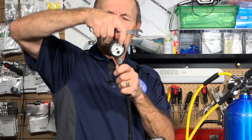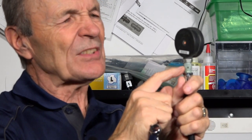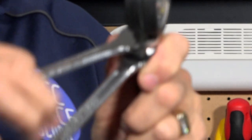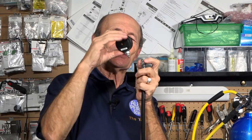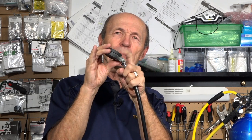Once the gauge is out, this end is similar to the second stage. You'll notice the end swivels. There's a nut on the hose and another nut on the gauge itself. Use two wrenches — one on each nut — and squeeze them together counterclockwise to remove the hose from the head. Don't try to remove the hose without holding that gauge nut, or you'll break the plastic case of the gauge.